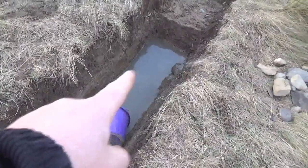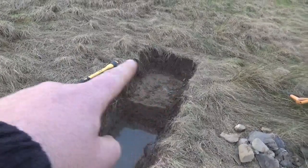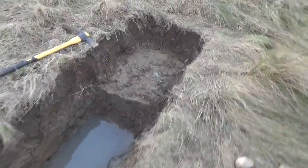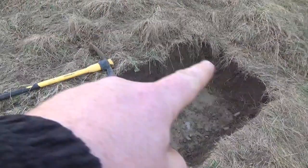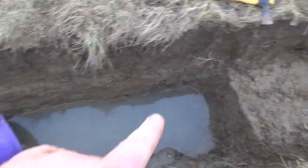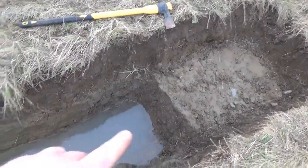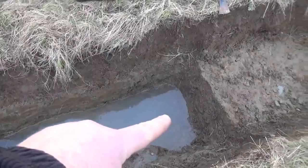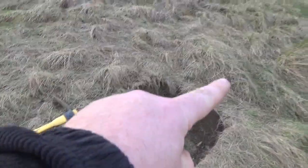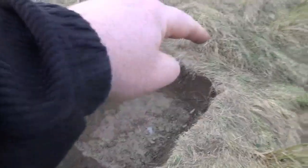The bottom half of it's filled with water just now, but that's about a foot deep — not very bad at all. That section there is just where I've cut the topsoil away in a nice square to get down to solid clay, and then I'll stand in that pit and mine that way until all that clay is down to about a foot below the water line, and then I'll remove the next set of topsoil, get down into the pit and dig forward again.